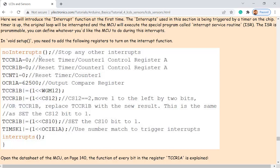You haven't done that yet, so probably couldn't imagine why it works in that way. So that's why it's better to just grab one number using the interrupt, show it, and don't change it. And after 5 minutes, you just need 1 second to refresh it, to update the temperature. So when people are looking at the temperature being mounted somewhere, for 99.9% of the time it's a stable display. Only during 1 second after every 5 minutes is it updating, which is fine, right? Instead of updating the temperature data every second. I'm going to show you how that looks after this one, after I introduce everything here.